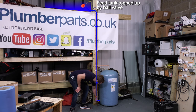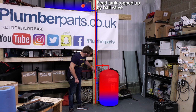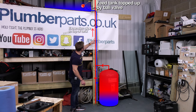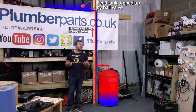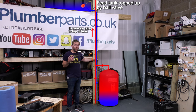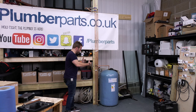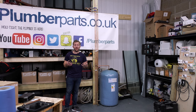We'll have our cold water all entering at the bottom here, going up through here, heated up by our immersion heater, and then we've got our hot water pipe just out there going down into our shower valve. We've also got our expansion pipe going up and that'll go over just out of shot into the top of the tank. Remember - you usually wouldn't do this in 15mm; all this would be done in 22mm, and then the last little bit going to the shower feeds would be in 15mm. What I'm going to do now is build our little bit of wall out, put our shower valve in, and pipe it up - and you're going to get a really good idea about what head pressure is all about and why sometimes we need shower pumps, but also why some shower pumps don't work because there isn't enough head pressure.